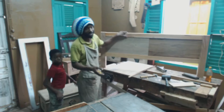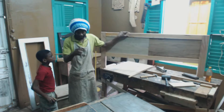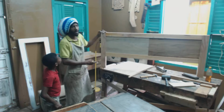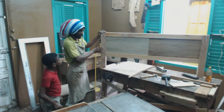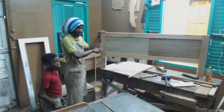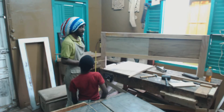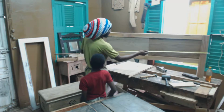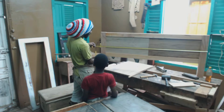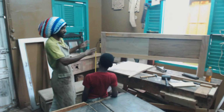That's the queen size. What is given as a queen size mattress? Is 60 by 80. Right? 60 by 80. That is what is considered to be queen size. And when we build our beds, we make the mattress sit flush here on the side so that when you rest the mattress on, it doesn't have any excess, because a lot of people look at the bed and say, oh, that bed is a queen size. Yes, it is. Because it falls on the inside of this panel here, 61¾. So that is actually 1¾ bigger than the mattress in width.